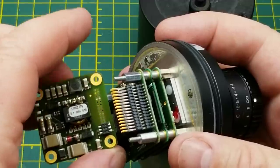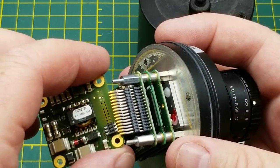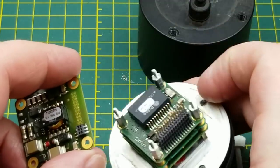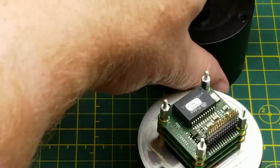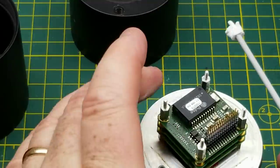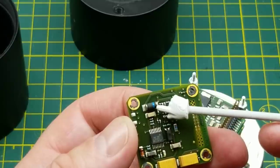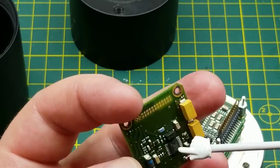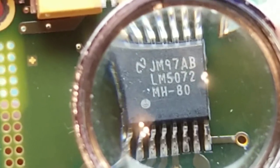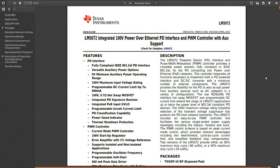That's interesting — between the top board and the lower boards it looks like only six pins actually connect through this little connector. The rest just pass through untouched and on to the back connector. On the back of this board we have another big MELF package and a smaller one. There's a chip — an LM5072. Given everything else on that board I'm going to assume that's some sort of power supply chip. Yep, exactly — it is a power over ethernet and PWM control chip, 100V maximum input and current limit up to 800 milliamps.